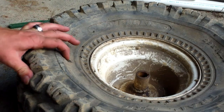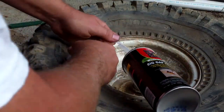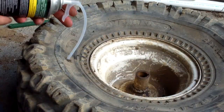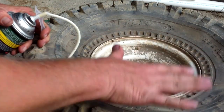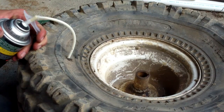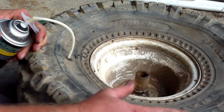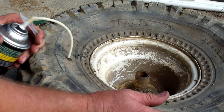This is a plug that I've just removed. This is the tire foam and we're going to insert it in here. I've done this for a while - you can do this on wheelbarrow tires, whatever. We're going to fill this thing up, leaving it laying on its side, and it is going to expand and swell up all the way across and around. It usually takes about five cans to fill up the void inside these tires, and I also fill them up with large pieces of scrap styrofoam that I find.